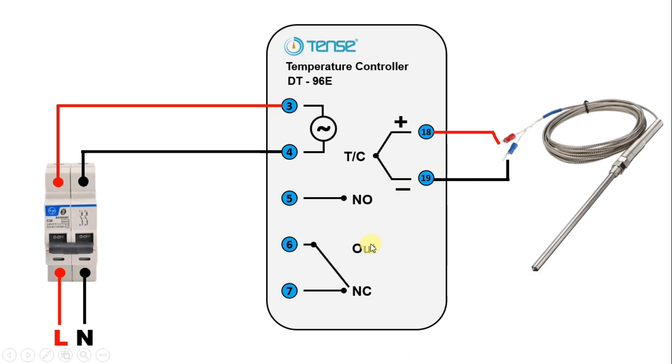After this, you have to decide which equipment you want to turn on and off through this controller. For example, I am showing you connection of a lamp. What I will do — from this phase supply, I am connecting a wire to this common terminal. Now after this, you have to decide whether you want to connect this lamp with NO contact or NC contact. First of all, learn to use NO contact. If you want to use NO contact, then this terminal 5 here — the NO contact — connect a wire from this terminal and connect this wire with this lamp. To operate this lamp, neutral power supply is also required, so we will connect neutral power supply directly with the lamp.